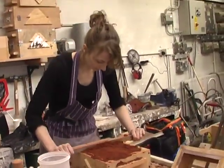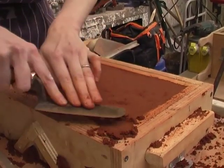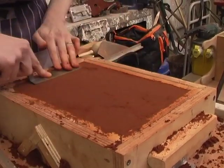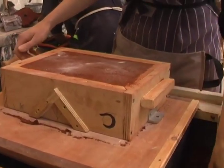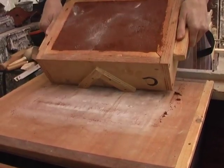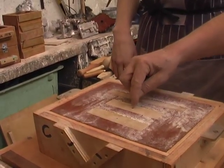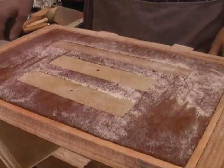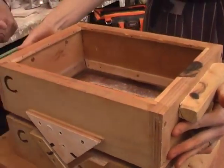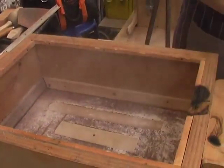Now the top of it is run off as flat and smooth as possible. That is the back of the pattern, and those little holes are quite important — they're where the screw will go to enable us to lift it out. It might be worth putting a bit more parting material on top to ensure the next layer of sand doesn't stick.